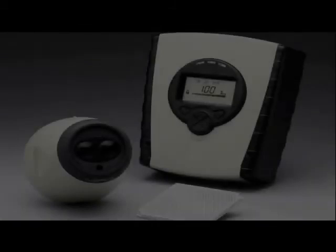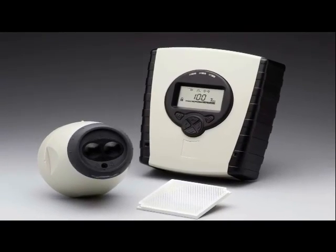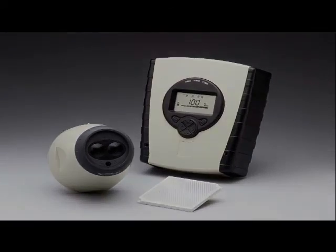For the fault test, using a non-reflective material, completely cover the reflector within 2 seconds. After the delay to fault time, a fault will be signaled. Commissioning is now complete. Please refer to the user guide and CD included with the product for further information.